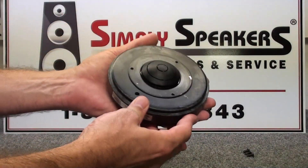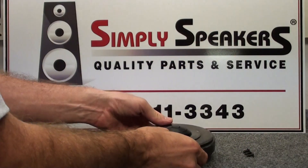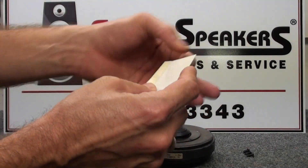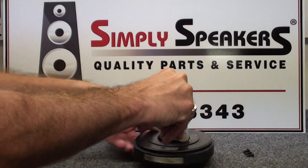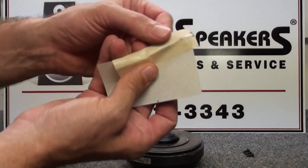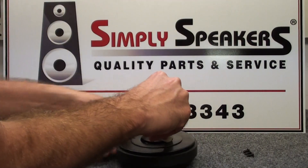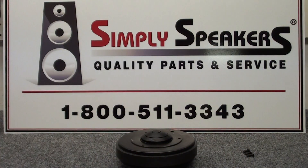We want to take a look and see if there are any remnants in the magnet gap. It looks pretty clean — everything looks to be in good order with no burnt wires or particles hanging in the voice coil gap. But for good measure, as usual, we'll go ahead and clean the magnet gap with a piece of sticky tape, sticky side out on a business card — works great. Just run that around a couple of times, spinning the magnet assembly with the tape folded sticky side out. We're picking up some dirt particles, so we'll give it a second run with a clean piece of tape to be extra sure everything is clean and ready to go.